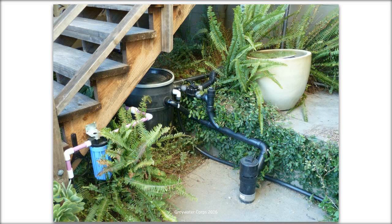Someone writes in, there's a question that says, what is a typical installation cost, not including repaving, et cetera? That's a good question. A typical installation involves three components. There's replumbing the house underneath, like separating the black water and gray water lines from the sewer and replumbing it out to gray water. The second part is installing the system, the pump, the valves, the basin, all that stuff, the electrical. And the third component is installing the irrigation.